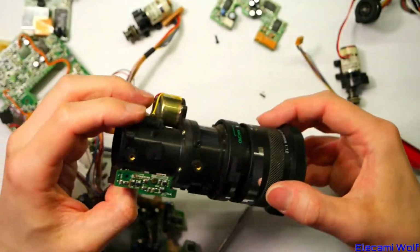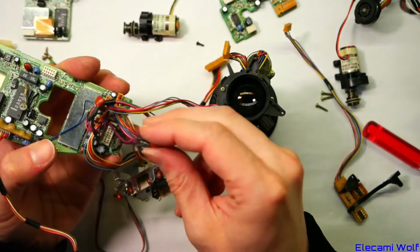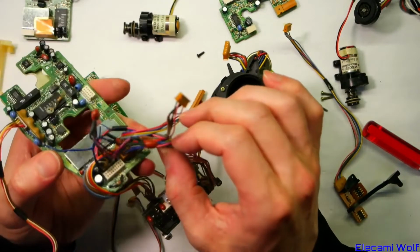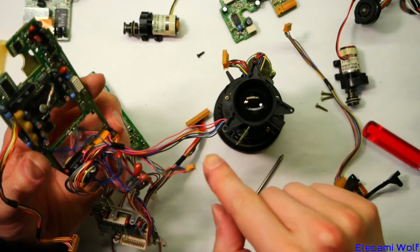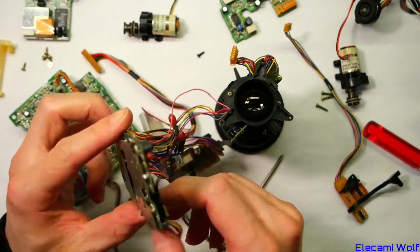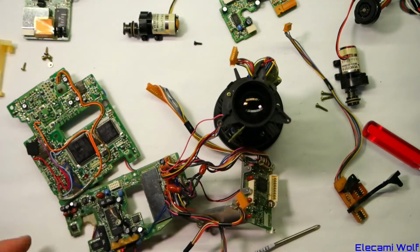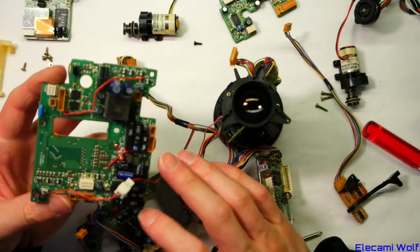All the dust has been coming out as I take it apart. Oh, look at that. There's capacitors up on stalks. Like tantalum capacitors. So that when they explode it doesn't catch fire to everything, maybe? Must have just been not enough room. Yeah, same deal with mounting that thing up there. Not enough room to have it on this board. Already busy with other stuff. So that's a double-sided through-hole plated board. Rare in this type of stuff. Well, less rare in cameras, but other equipment of this age generally doesn't have that type of circuit board.